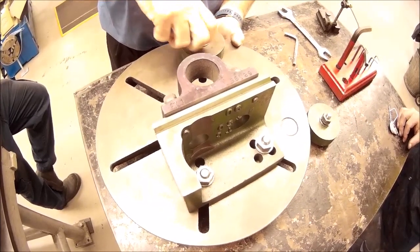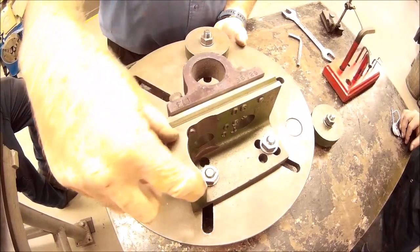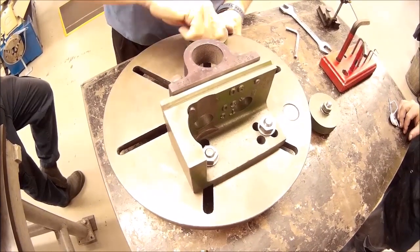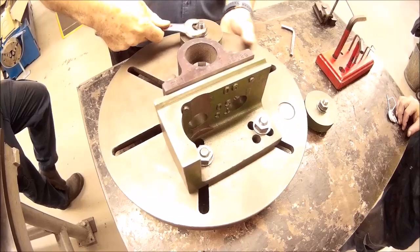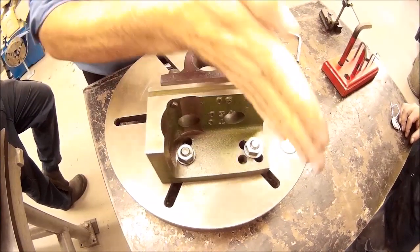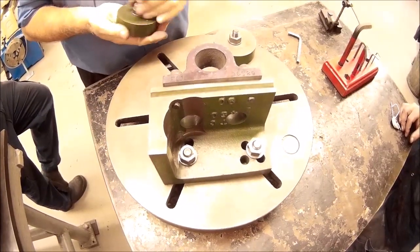If I have a look at the angle plate I'm using, I have a large mass sitting here, so directly opposite that I need to put a bigger counterbalance weight, further out from the center line of rotation. If I look across this plane, I don't have this big mass there, so I can have this one in a little bit closer.